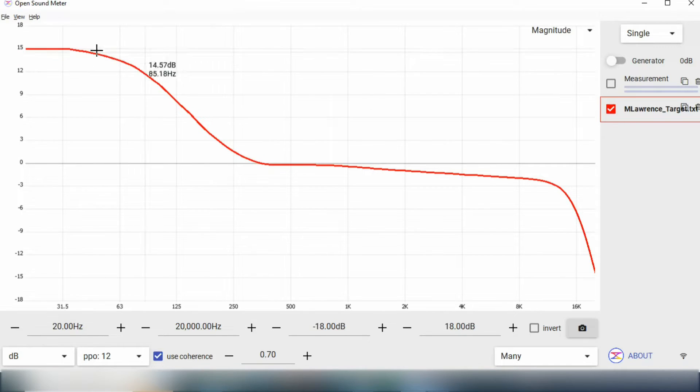As you can see, it's not flat. I have a huge boost in the low end — about 15 dB increase. Then from the low mid it starts coming down, becomes a little bit flat all the way to the high mid, drops down a little bit, and then drops down at high frequency. There are two reasons why I adopt tuning my system to this shape. The first is that human ears perceive sounds differently across different frequencies — we are more sensitive to high frequencies than low frequencies, so boosting the low frequency to some extent helps. The second reason is that the kind of music we'll be doing involves lots of kick, lots of bass guitar, and it's very energetic. This really works for most contemporary-style music.